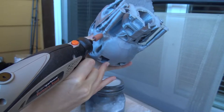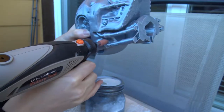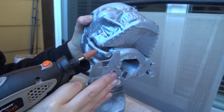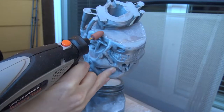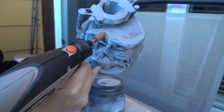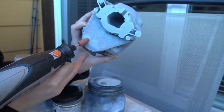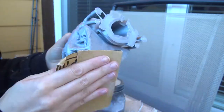Now let's go directly to the finishing of our model. To start the finishing process I'm gonna take this rotary tool and sand the surface to remove certain imperfections that remained after printing — such as remaining support material still attached to the model, or imperfections caused by fluctuations in temperature or filament quality. After the rotary tool I'll switch to sandpaper between 200 and 400 grit to remove smaller imperfections without removing any details.